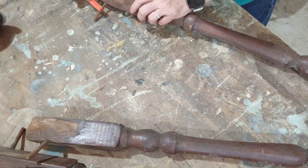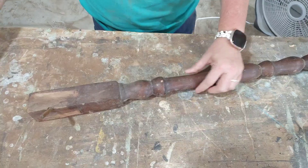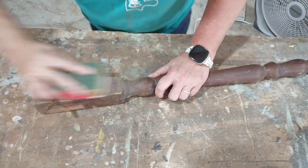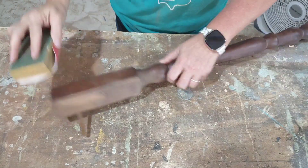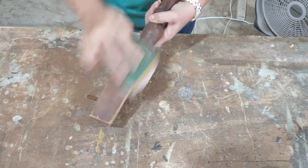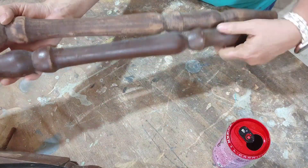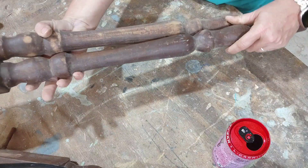The legs were in really good shape — there wasn't any damage. I'm just taking a wire brush and scraping off the rust that was on the bolt. Then I'm going to take some 220 sandpaper and a foam sanding pad and work a little bit on the legs to get any loose stain off. My goal is not to completely strip them, but just get them ready for paint.